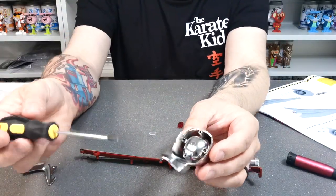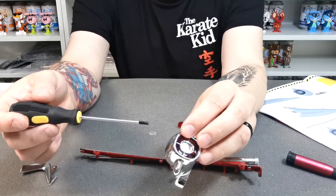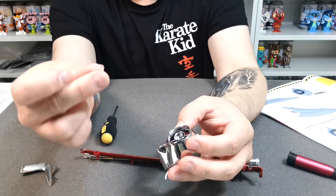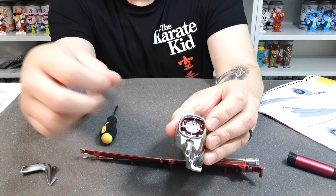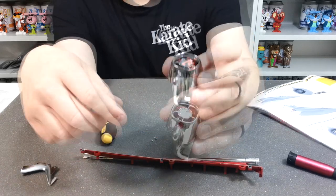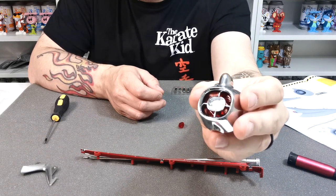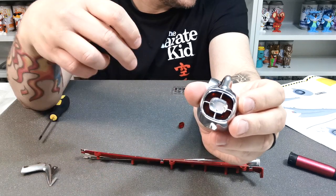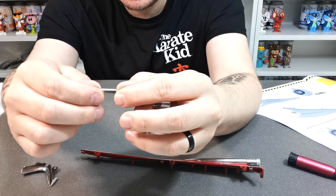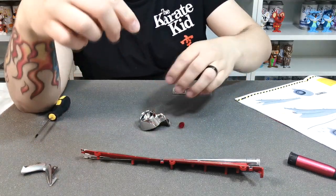The two AP screws are now in — one here and one there — holding 112a into 112d, the chrome section. On the front there's a tiny lens that just pushes in, and three very small RP screws hold it on. I used a CRV PH triple zero bit and actually just put them in by hand because it's so delicate it didn't need the screwdriver.